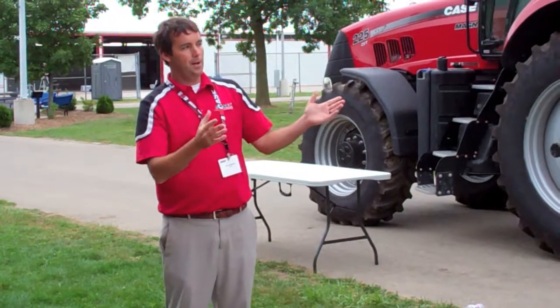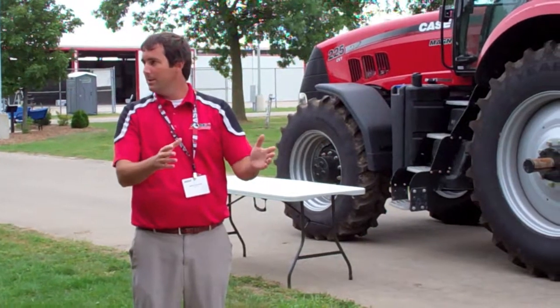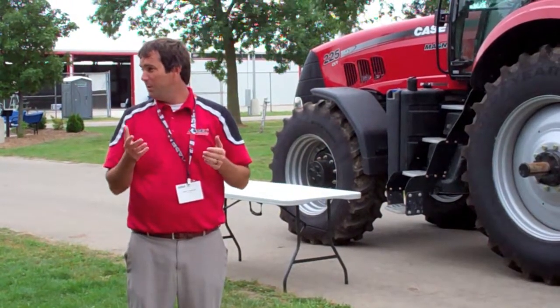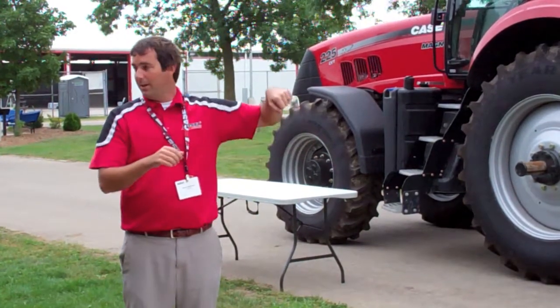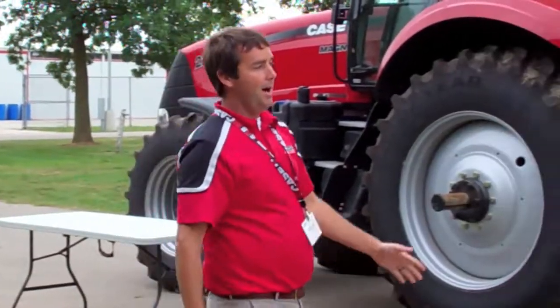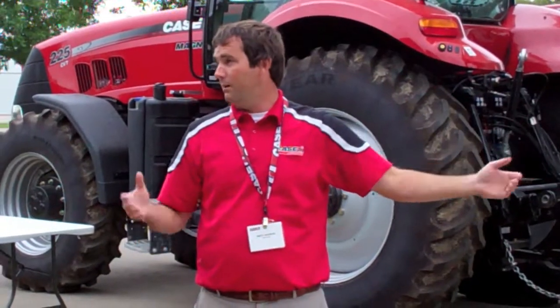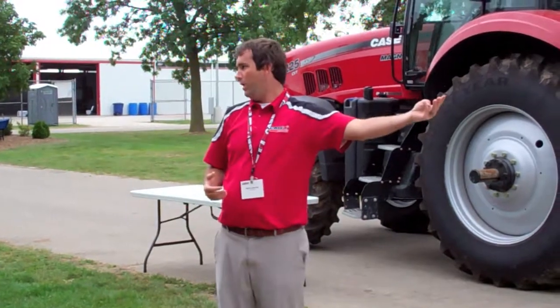Another thing is, you finish a job, say you're a custom guy or say you're done for the season, and you've got a couple bales left in the chamber. How do you get them out? Well, with our machine, basically, the density cylinders, you turn the valve, and then there's another valve here on the back. You just pull the lever down, the bale comes out, but it doesn't stop there. There's always that bale clear in there. Maybe it's only a half, maybe it's 3/4 of a bale. But how do you get that one out? We have hay dogs in there, and we can pull that out hydraulically as well, so you don't need to crawl in there to get that bale out.